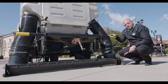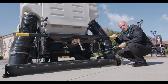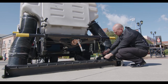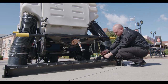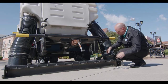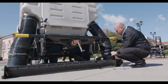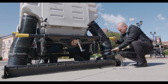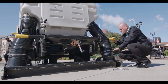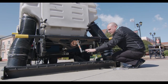Another feature on the SuperVac Aero is the leaf bleeder door, which is located on the passenger side rear of the sweeping head. By loosening the bolt — it's a 3/8 bolt, so you would need a 9/16 wrench and socket — loosen it up and you should be able to open and close the leaf bleeder. In heavy material, you want the door shut. This will allow more blow-through through the head to push debris across to get sucked up.